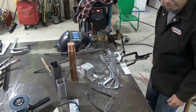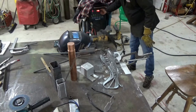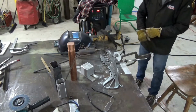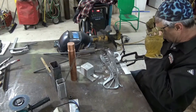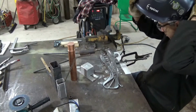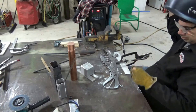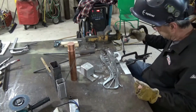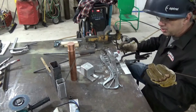I'll put a weld there, turn it over, put another weld on it. I'm going to use about 115 amps on the welder. I want to get my spectacles on so I can see, and then we'll put them together. I hope my head's not in the way — you'll get the gist of what I'm going to do.